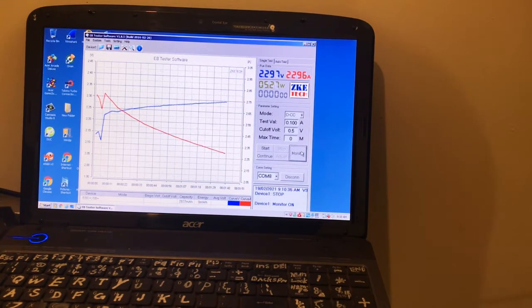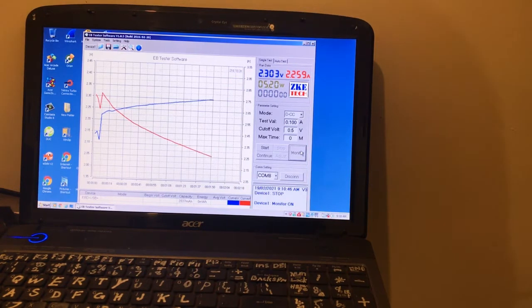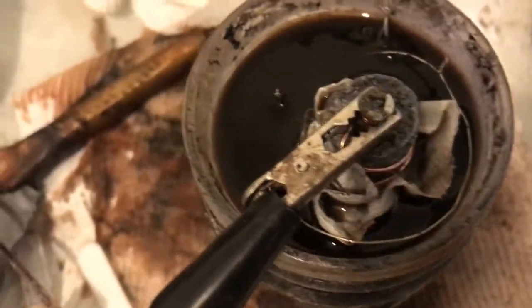So we'll see how this goes. It might need a couple of charges. I'll try an hour first and see what happens. Not sure how it will go. There's not much room because there's too much material in there. And also the cell's starting to come apart a bit when I pulled it out of there and handled it. That separator wasn't broken, so I think it's the outer 7 molar solution of potassium hydroxide may be too much for that carbon.